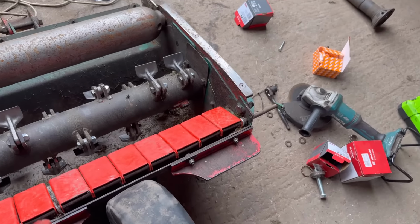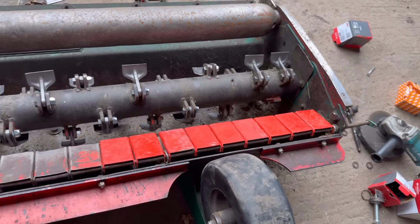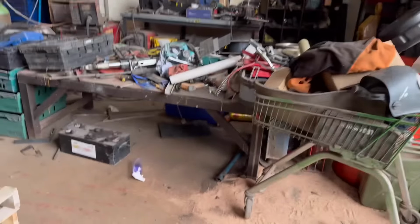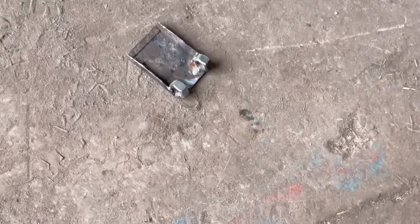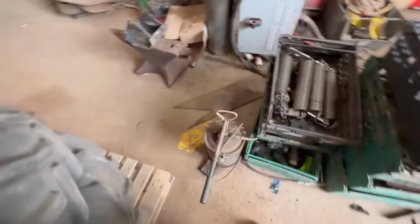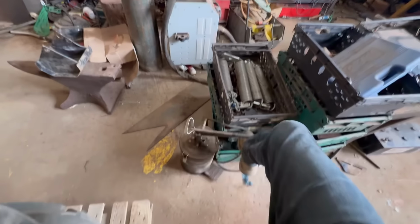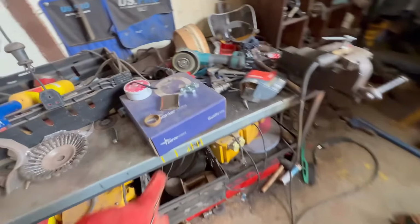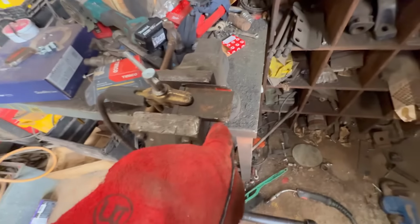This is going back together now, but we've got a few flaps short, so I'm just repairing some. I'll just straighten them out and weld nuts to them so that they're a bit stronger. Who keeps turning that round? I keep making it so you don't trip over it. Yeah, just getting these nuts, welding them in the corners where it's snapped.